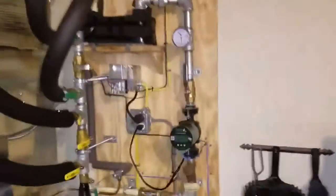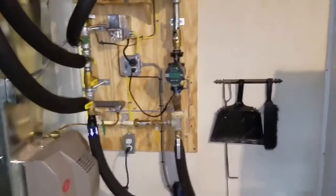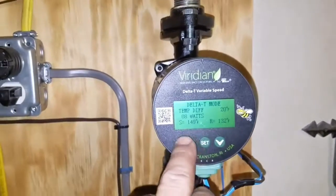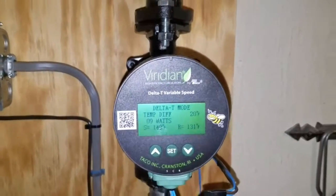What I did was hook another loop into my boiler, pumping the hot water through another coil and drying clothes with it. It's working really well. Here's my boiler setup as it comes into the house — the wood boiler is outside, and right now my water is 149 degrees coming in and 131 going back out.